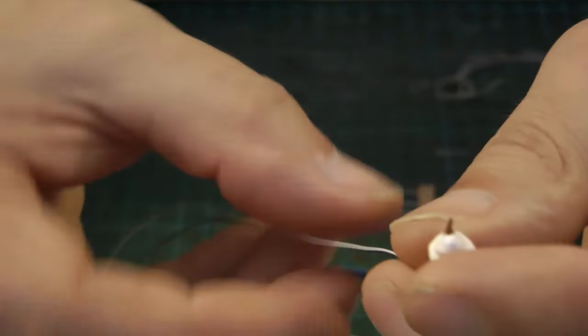And as for the other LED, I've just drilled a 3mm hole into the base of the kiosk. So that'll just pop up through the floor. And the trailing cables coming down from the ice cream will meet up with this LED. And then I'll only have to drill one hole into the baseboard. So that is what I'll do for there, and I think that should work.